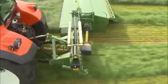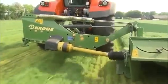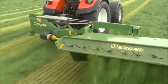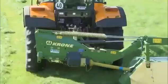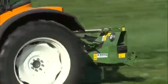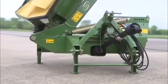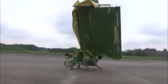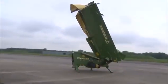The mower is powered by a drive shaft, not belts. It is this constant speed and powerful direct drive concept that makes the easy-cut mower so dependable in the most challenging conditions. The easy-cut headstock is built heavy for dependable performance. The design of the mower allows it to be stored folded in the transport position to minimize the amount of storage space required, and it safely rests on optional stands installed to the machine.